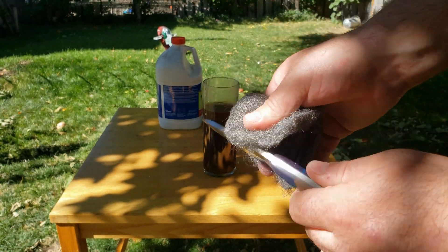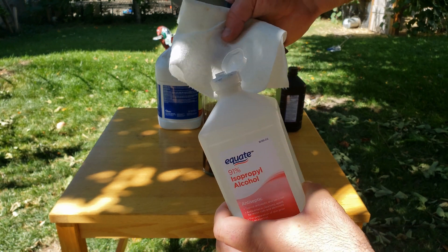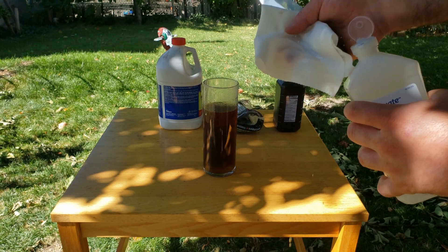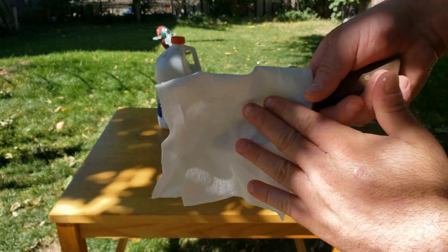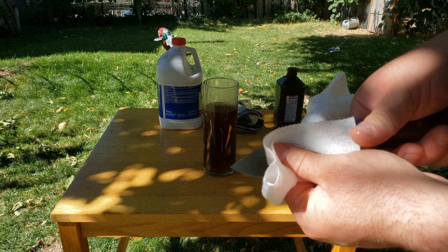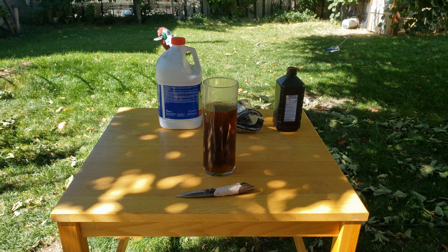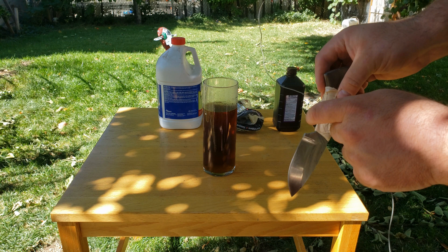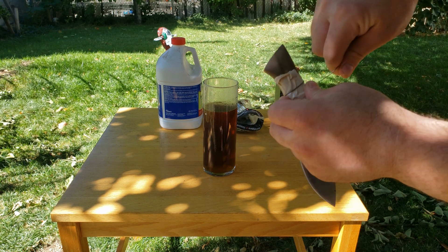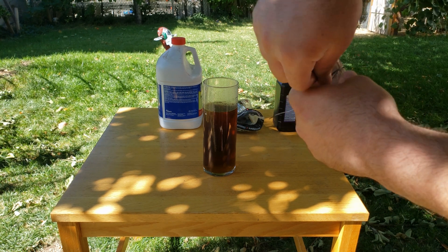First, I'm going to scrub it with some steel wool to get off any oxides that may have formed on the surface. Once that's done, I generally clean it off with acetone, as that's the best at getting off the oils. But I'm not at my shop right now and I wasn't able to find any acetone here, so I'm just going to try some 91% isopropyl alcohol and hopefully that does the job. Now we just need to let it sit in the solution for a little bit to get the etch done. I'm just going to wrap a little bit of wire around the handle and use that wire to suspend the knife over the container so just the blade gets in the ferric chloride and the handle stays out as much as it can.